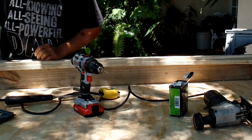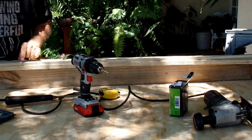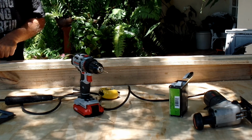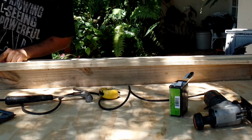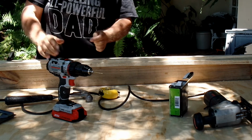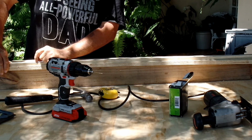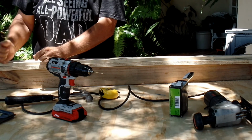Okay, now I'm going to see how far we can go here. What you have to do is just take your thumb and pull your guide to the line and see where it comes. If it starts to touch and is not there on the upper end, you just have to back off and say here's a nail point, and then come finish it off later up higher. And I got to put one right here. So basically it's going to be a matter of feel. You're going to look at your line, bring your router guide up, bend it. When it starts to come around your line, you're going to have to mark it, drill your pilot hole, put your brad in there, and then work up. You're going to probably be able to go 3 or 4 inches to an anchor point.